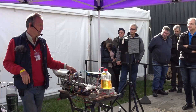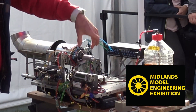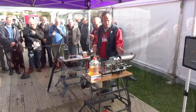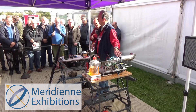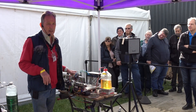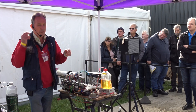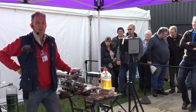Gas 66 very simply is the rotor diameter in this particular instance. We've got a single stage centrifugal compressor at the front which is 66 millimeters diameter, and there's a single stage axial flow turbine at the back which is also 66 millimeters diameter, and in the middle we have a vaporizing combustor. Our primary fuel is kerosene or paraffin depending on where you're coming from, and that doesn't vaporize at ambient temperature.